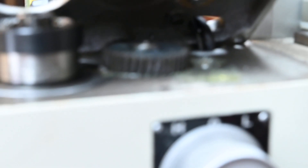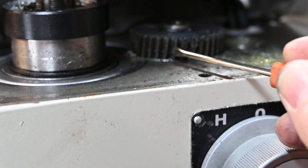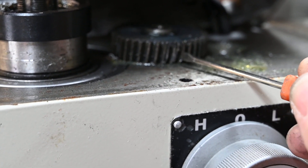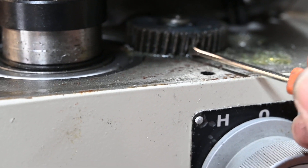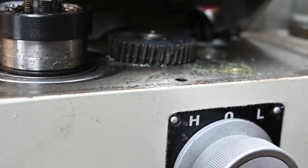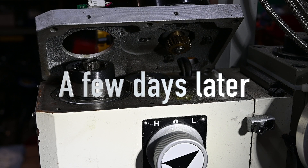Alright, I've found what I think is the fault, but it might not be. The teeth on this drive gear - for some reason in this position - I think it might have been when I overloaded it the other day trying to use a 16mm drill bit. The teeth seem to have deformed. Anyway, I've contacted the supplier to see if they've got a spare.